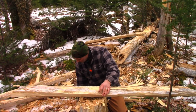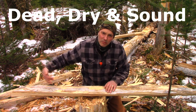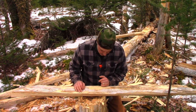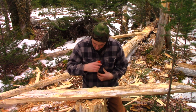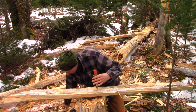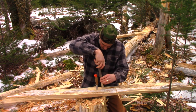So here we've got a piece of wood. I'm hoping it doesn't get too many cracks and we can get one paddle out of it. It's dead wood, which is what you want to use ideally. It's got lengthwise cracks — you've got to read it and hopefully get a piece where the crack isn't down the middle of your paddle. I can see a crack right there along the thickness — no matter what I do, I think this crack will probably take over the wood. It's too wide to be a paddle anyway, so why not use that crack to reduce the thickness. I'll just take my knife and get it started a little bit, then use one of the finer wedges right next to the knife.